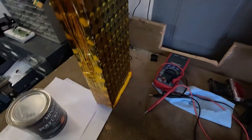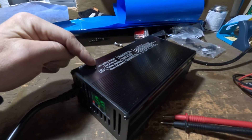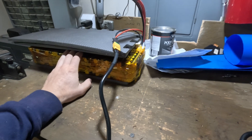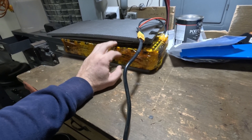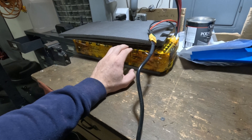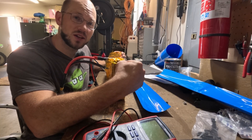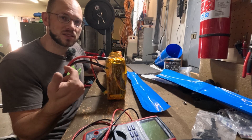That's as simple as it gets. Check this out — we have our charger, a 10-amp charger from AliExpress that even has a percentage display showing how charged it is. Next steps: we've got our Kapton tape on it. I wanted to put fiberglass tape on it before the next layer, but it got stuck in customs and sent back to China, so we're forging ahead without it. We have two layers of Kapton tape on the battery and silicone on any spots where wires egress outside the battery. Now we just need to put some PVC shrink wrap on it.